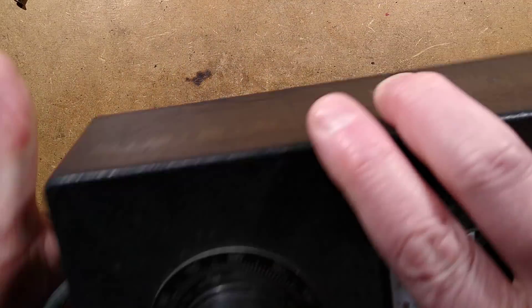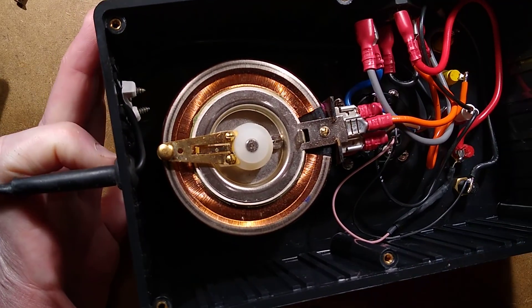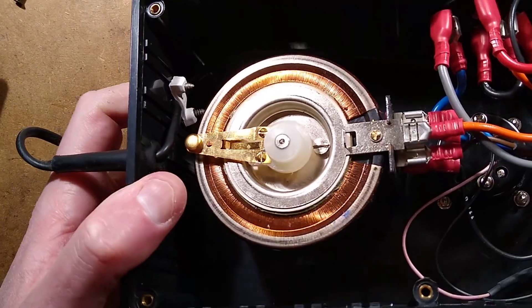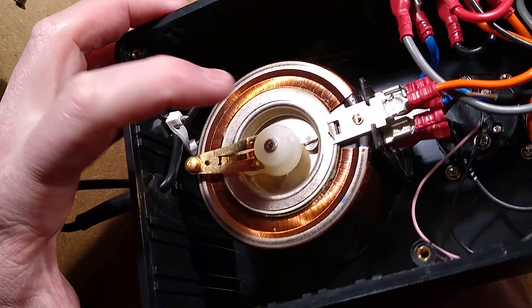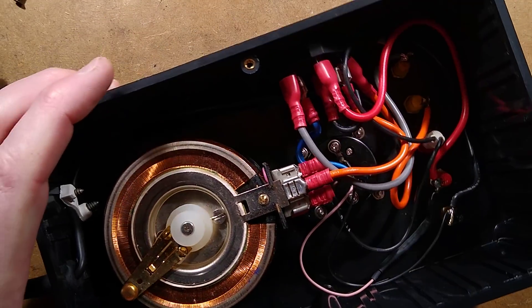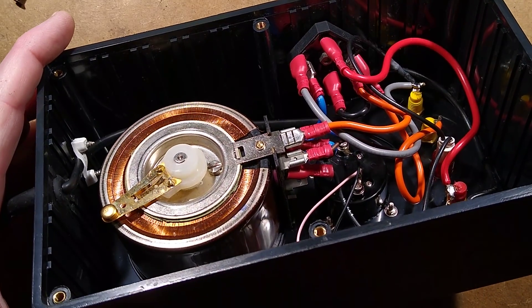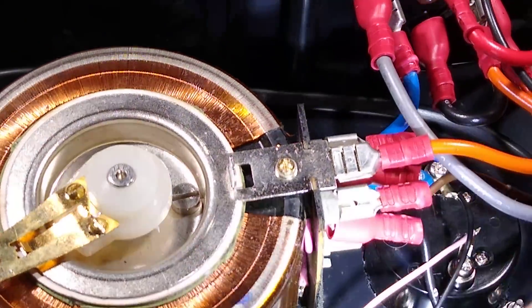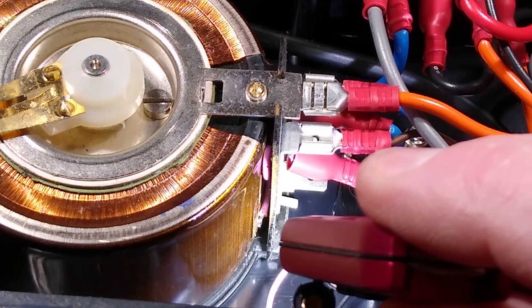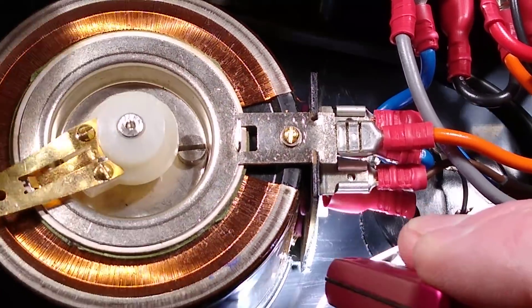With a bigger Variac it would be more complex and more losses. If I bring the thing back up — here is the slip ring. There's a carbon brush, a nylon bush to connect it to the handle, and it just wipes around those windings like that. And at the end — if I shine the light in here, can you see the little solder connection at the bottom where it's just soldered onto the side of the windings? It's quite neat. This is quite a thick layer of lacquer. It's quite a complex transformer.